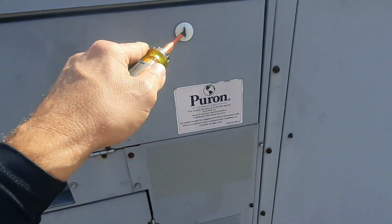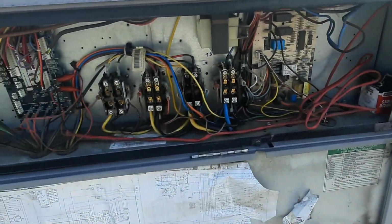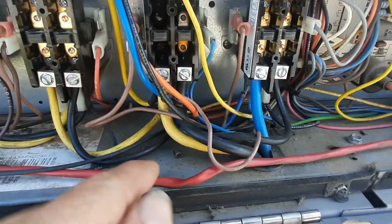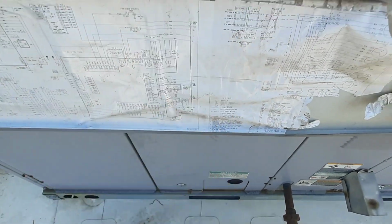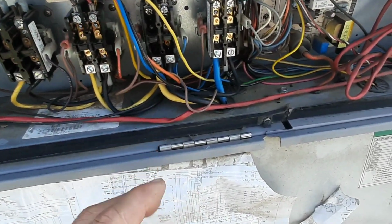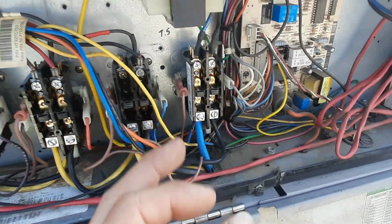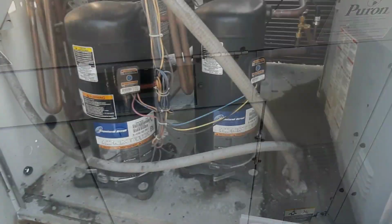see what's going on. We had a low pressure switch fail as well. There's a problem there. That's C1. Blew the spring out and lost a contact. So let's see why that might have been. This got 2 new contactors, I think, at that time, and the other ones looked okay, so I'm not sure what happened there. That one might have got replaced too. So we might have a compressor problem, but it feels like maybe we've got one compressor running. So let's get in there and take a look.